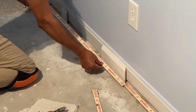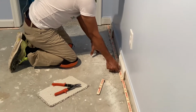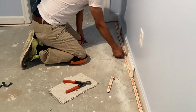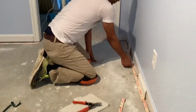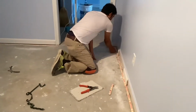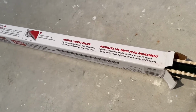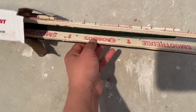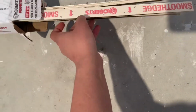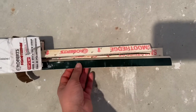So what you have to do, you have to keep a half an inch of gap from the board. You see that I'm using a piece of wood to make that gap. You will know why. That gap between the stick and the wall is for the carpet. When you push it inside the side boards, that is required, and even for the cushion.